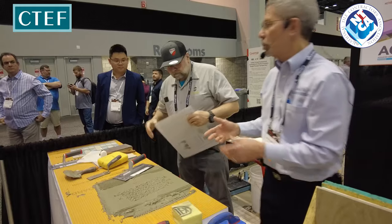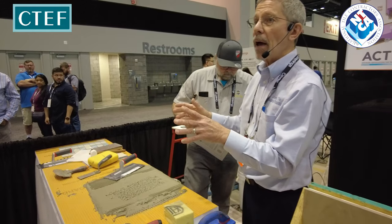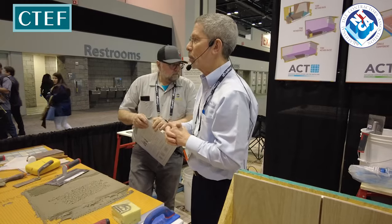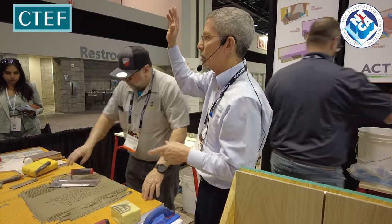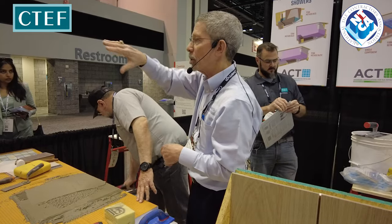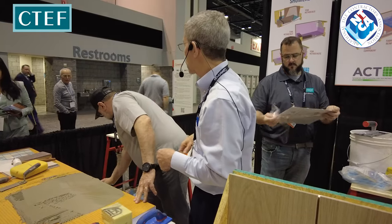Now, we're going to use this last mosaic. In this case, unfortunately, we don't have any white thinset. In a show like this, we just had no availability of white thinset. Has anybody ever set translucent mosaic with dark colored borders? You can see the trowel marks on the tile. So you always want to use white thinset for installing these products.